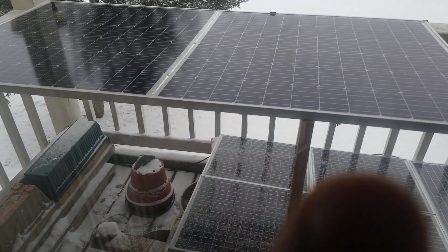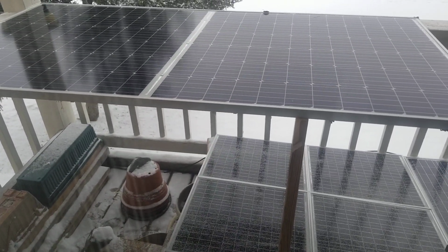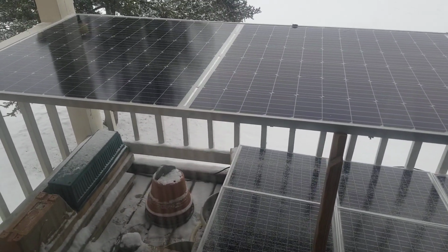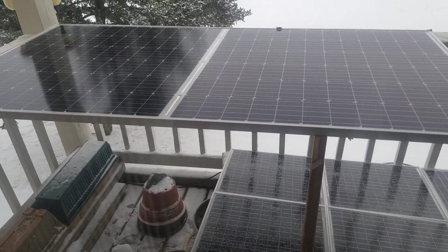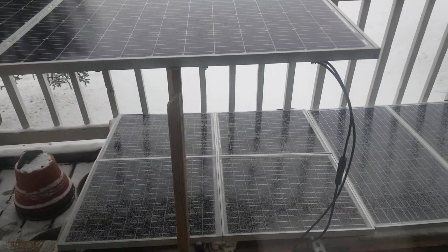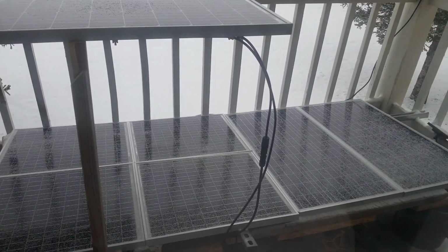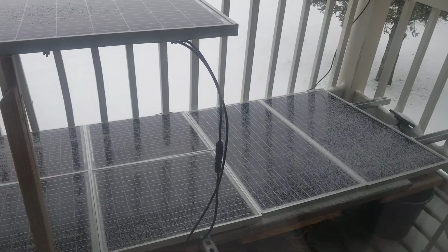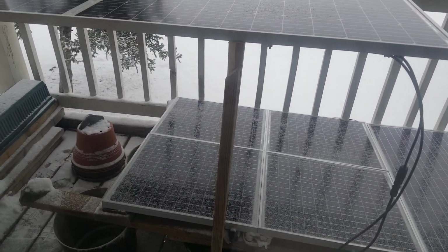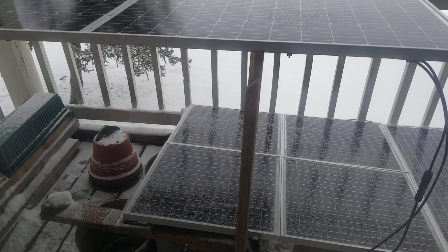So the Canadian Solar is a bifacial. Like I said, it's collecting the reflection underneath. That's why you're seeing the ground right there. That's why it was bringing that 1 amp you see in there, and it keeps the voltage up though. And at the end of the day, you see the voltage is rising, or keeps going up. But now, because it's already below the threshold, you can see we don't produce that.